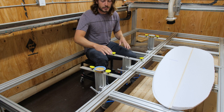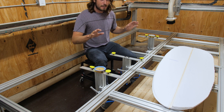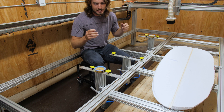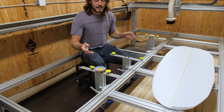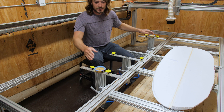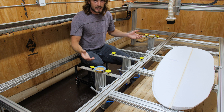At first I was using four posts with four vacuum pads, and what I found is that the more vacuum pads you have, the more the vacuum system leaks, so it actually gets harder to hold the board down. What I ended up finding is that just one vacuum pad on the front and one on the tail of the board is more than enough to hold the board down and it doesn't leak that much.